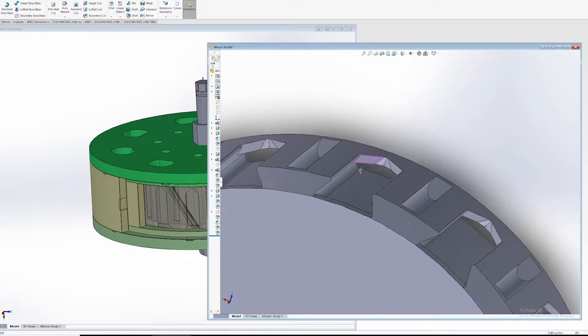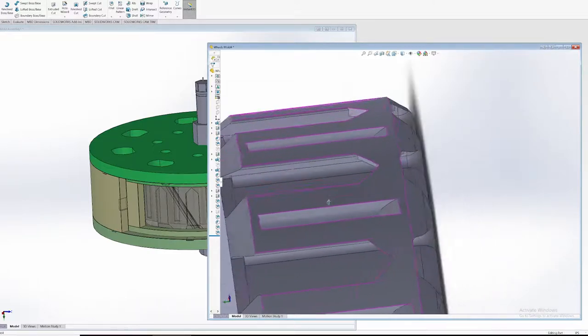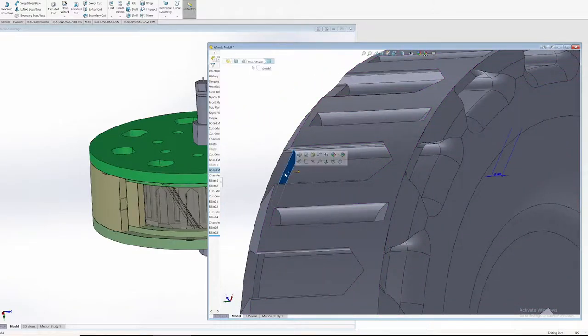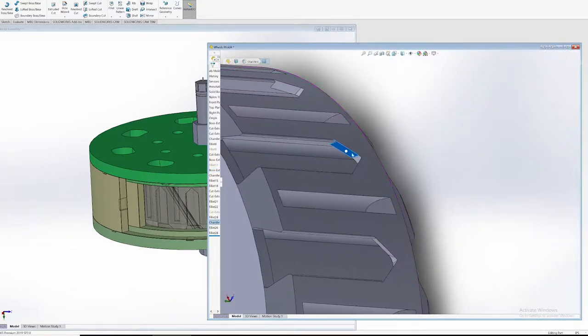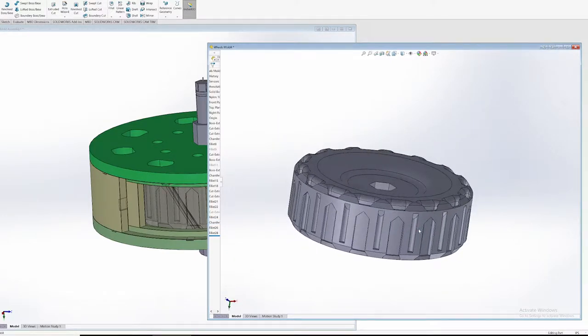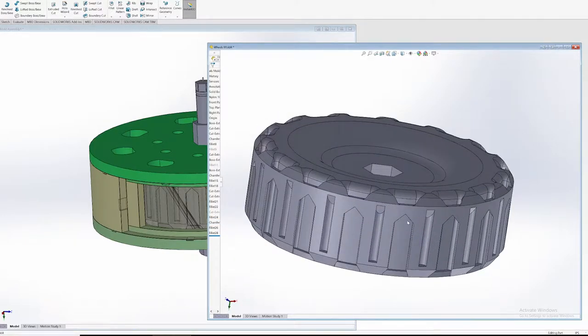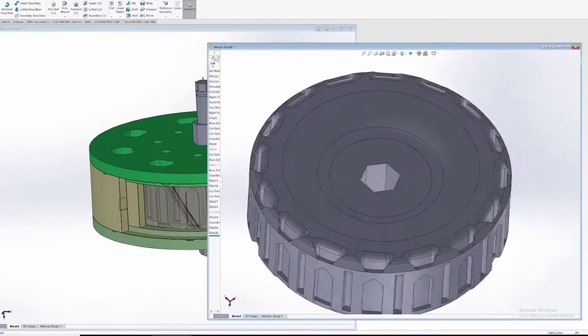There's this little curved piece here that stops the rubber from pulling up. I have some other features like this sidewall here and then this overhang area here, which stops the rubber from pulling off either to the left or to the right. It's also designed to be 3D printed without supports, which is another reason why it looks kind of funky. If this were machined out of aluminum it would probably look a lot different, but because it's 3D printed without supports it looks this way to simplify printing.